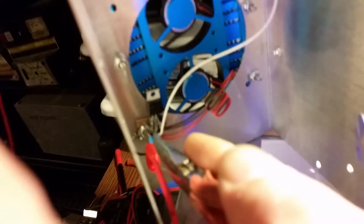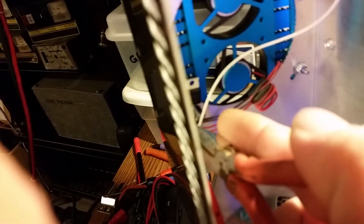This right here is a 104 cap. I'm simply going to take this cap and hook it up to the input and to ground. You hear it — it stopped. Hook it up again — hear how it stopped.